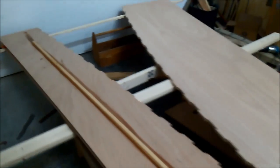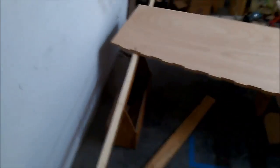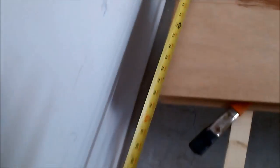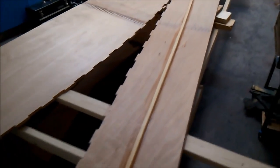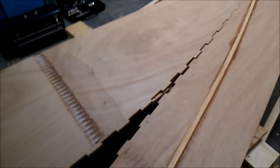To get the hull panels aligned, you'll see on the plans there'll be a dimension for the back corners. In my case it was 78 inches from corner to corner. You just measure from that corner to this corner, and that dimension sets the angle up at the bow so you know you get the proper alignment of the two hulls.